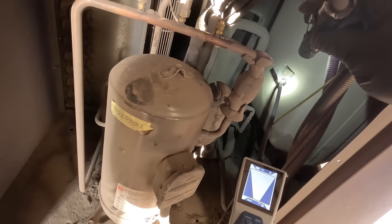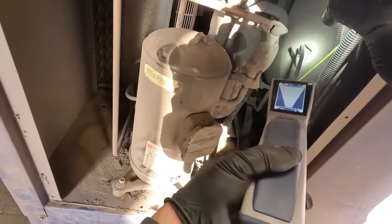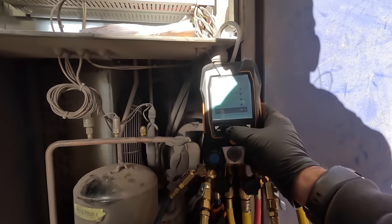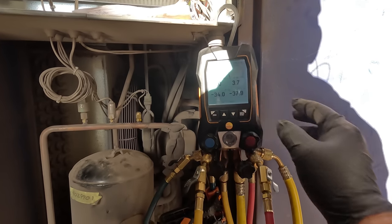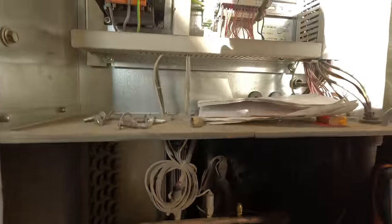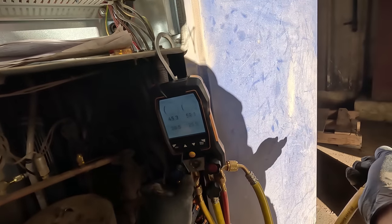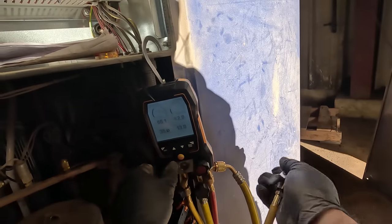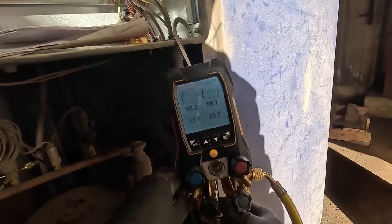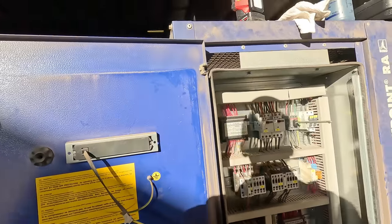We just cut a little hole in there — that looks like stainless steel. If it was leaking down here at the bottom it would surely be going nuts. This unit is made in Italy, which — no offense Italy — we usually have a heck of a time getting parts. We're at 58 psi, which is about 25-30 degrees. That seems a little low. Both sides are bled out so that if we need to add or dump refrigerant back into itself we'll be fine — won't get air in the system. Non-condensables are all the other crap that seems to be happening a lot anymore.